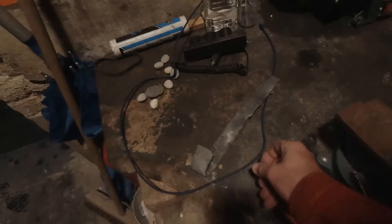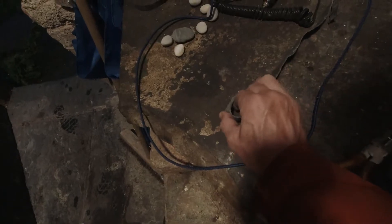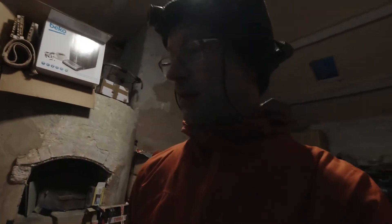Another reason these slates fail — you'll see lots of tabs on this roof from previous pieces being replaced. What happens over time is if the weather is really hot, the lead will heat up and flex and open up, and eventually open up enough that the slate will just slide down. So that's the idea — got to go and replace this.